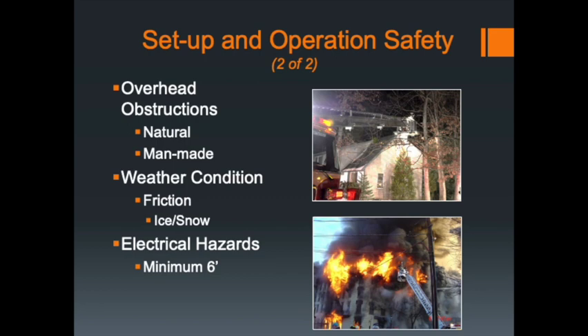Also be cautious about the buildup of ice and snow on the boom itself. If you take the boom of Truck 5-2 and add water that starts to freeze, just imagine the amount of weight you're adding to the apparatus. Another weather condition not listed here is the effect of wind. You can see on the information plate on Truck 5-1 that the ratings of the boom change once you exceed 50 miles per hour wind speed — that's going to start reducing the working loads of the apparatus.